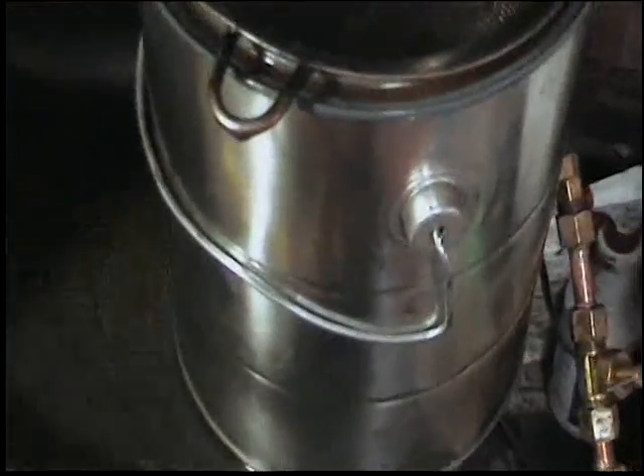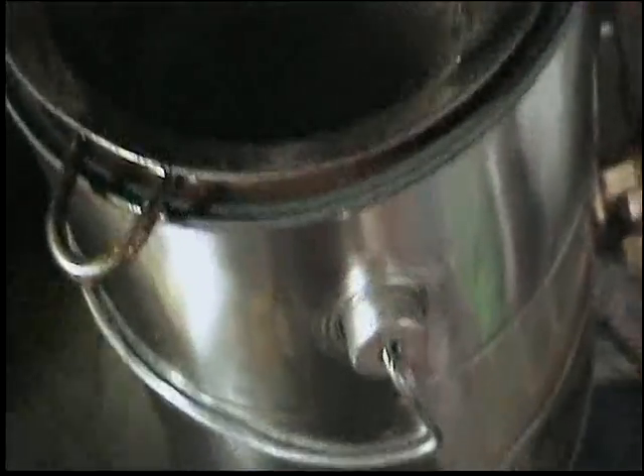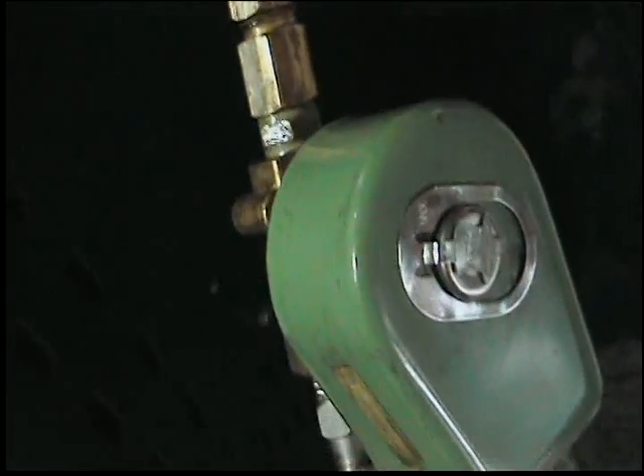Here we have another one-gallon container filled with waste vegetable oil. I use a little strainer to catch any bits that might get caught in the valve. It uses a 3/8-inch copper tube going to an electric solenoid valve, then to a quick disconnect so the burner can be easily removed. Then the quarter-inch tubing comes into the door and into the firebox.